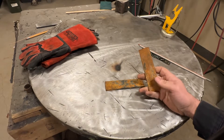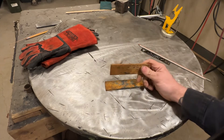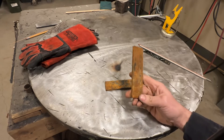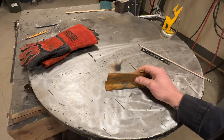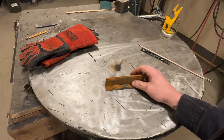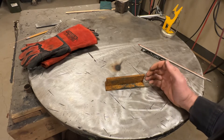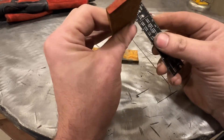Today's video covers the topic: can you weld over rust? This material has more than surface rust - it doesn't really come off and would take quite a bit of grinding to clean up. Rather than doing any grinding or prep work, I'm just going to tack it and weld one side with 6010 and the other with 7018, then do a cut and etch to see what happens. We'll compare it against clean metal with new rods to see what effect rust and poor material prep actually has.